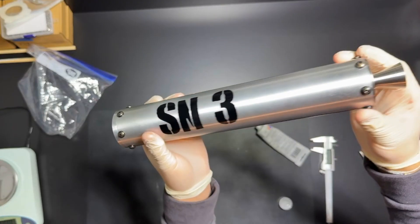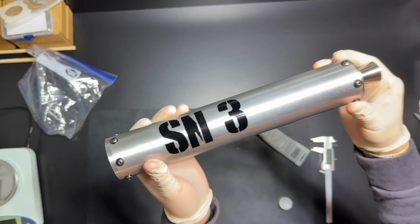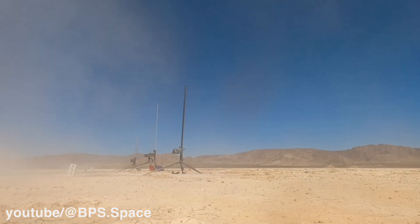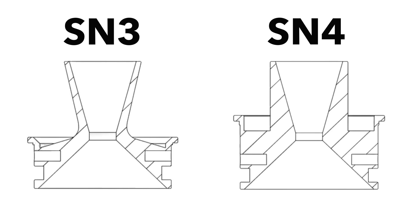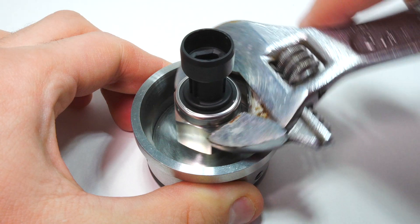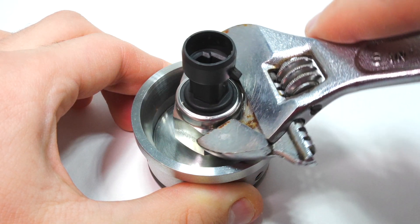Visibly, SN4 stands out compared to SN3 and other motors. Unlike other motors I've made, SN4 is designed to fly. This motor has many improvements over the others, such as external nozzle geometry and a pressure sensor that I'll go more in depth with later.